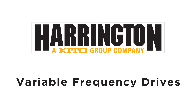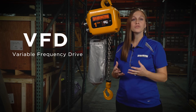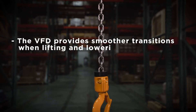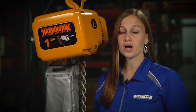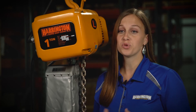Let's talk about our VFD offering. VFD is a variable frequency drive, and all of our dual-speed hoists come standard with a VFD. So unlike contactor-controlled hoists, the VFD provides smoother transitions when lifting or lowering loads, and the speeds can be adjusted based on your application. There are a lot of other troubleshooting and maintenance features that come with a VFD that you wouldn't have without it.